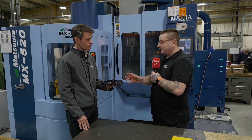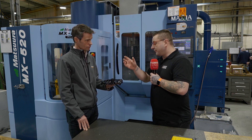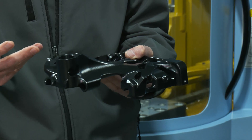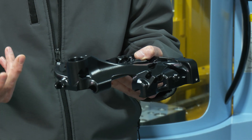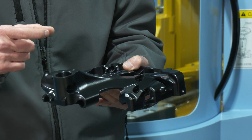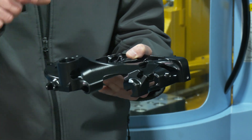We've roughed that out — now it's time to get some of the pocket material out. What would I be using to remove the bulk of these pockets? Then you're into a potential rest roughing type scenario, so you're probably into end mills or tipped style cutters, something of a much smaller diameter. You really want the largest tool you can find that will fit in those areas to get as much material out as quickly as possible — you don't want to go too small too soon.